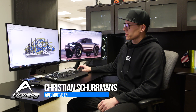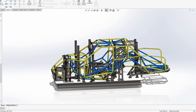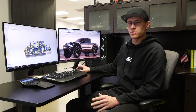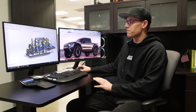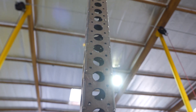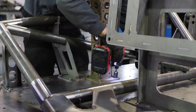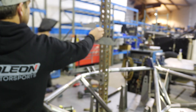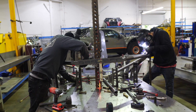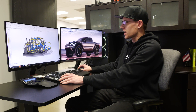Right here on screen we have the finished chassis and chassis fixture assembly. We finished the chassis a while ago and were ready to start building, but to make sure all the tubes end up in the correct position we had to set up a whole fixture assembly. We made a big chassis fixture mostly out of sheet metal. We use long uprights bolted to the chassis table, and then we bolt laser cut sheet metal parts to the fixture uprights so we can accurately locate all of the suspension positions, the tubes, and any other important positions of the chassis.